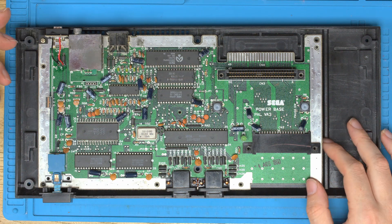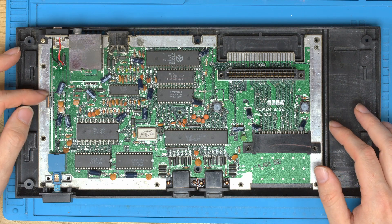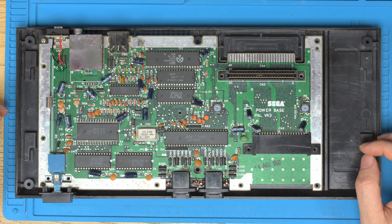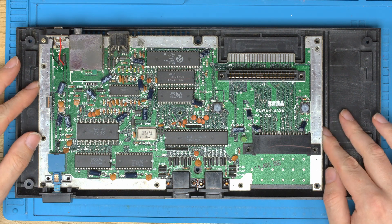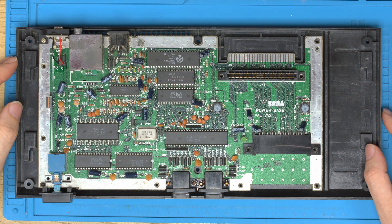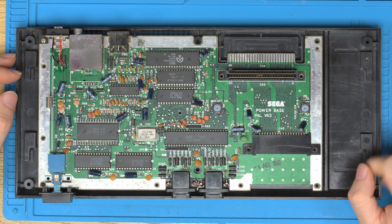It's a nice simple install — just remove the DC jack, screw this in place, and bridge the regulator underneath. It's fully reversible if you maintain your original DC jack and just remove the jumper wire. I've done so far the Dreamcast, the Sega Saturn, the Master System 1 and 2, and the Mega Drive 1 and 2 — although a few of those aren't out yet, they're in production. If you want any other consoles USB-C modded, let me know. Also, if anybody wants these for free and is willing to do unbiased review videos, reach out to our Discord — I love to send these out to anyone willing to review them and give honest feedback.